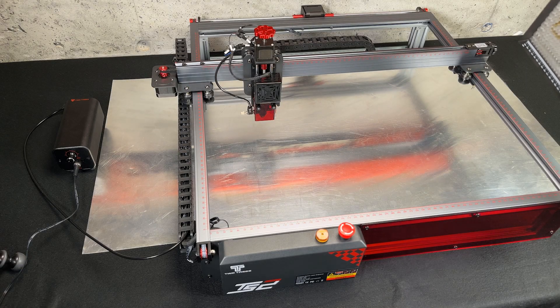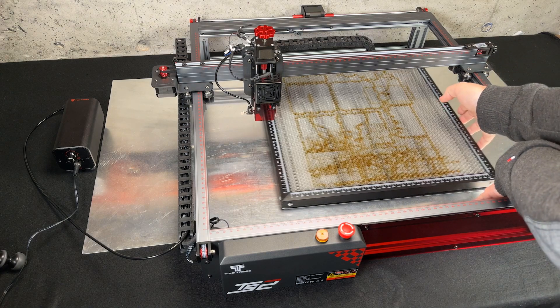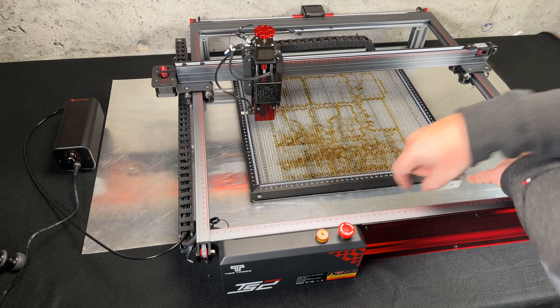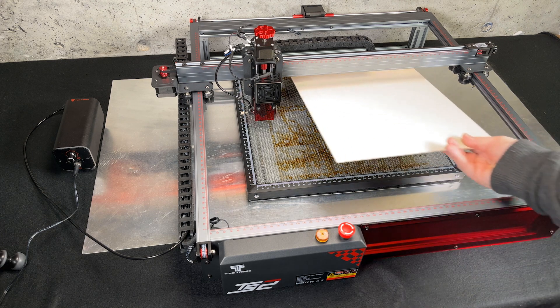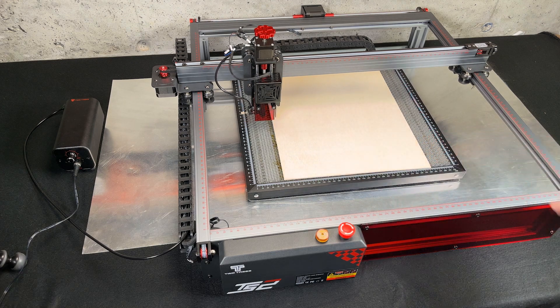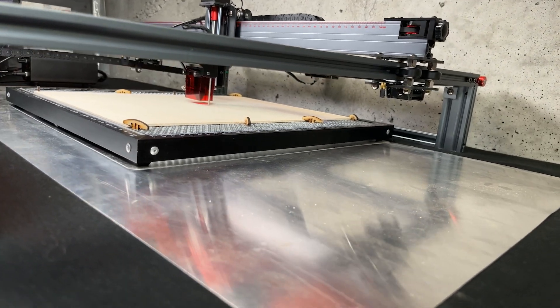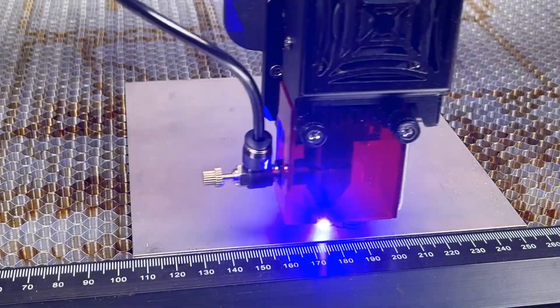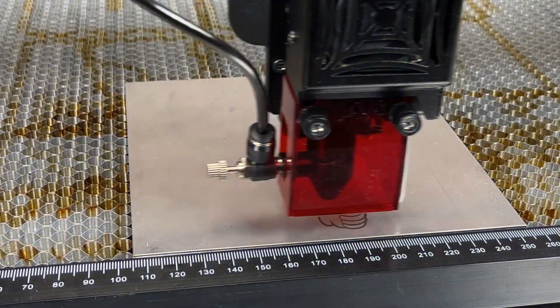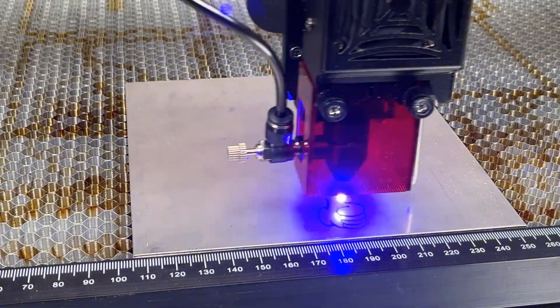The next great feature of the laser is the open sides. This allows you to place materials much easier without always having to move the laser head, and you can also place wider items in the laser as well. This might seem like a small feature, but not having to squeeze your materials in makes the laser so much easier to work with on a daily basis. The laser is also powerful enough to engrave stainless steel — here the laser is running at 3,000 millimeters per minute at 100% power.